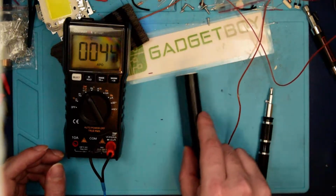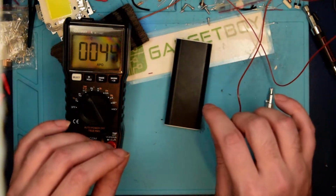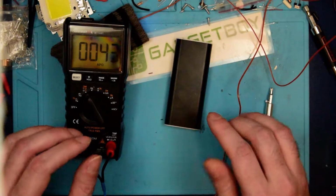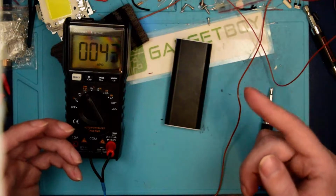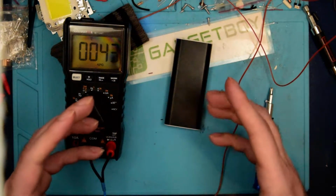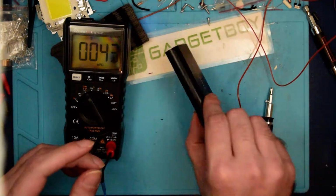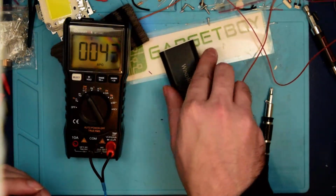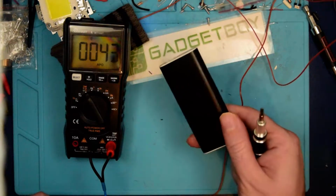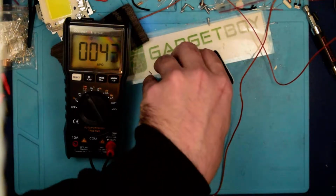I think we're going to have one and maybe two of those graphite-infused fiber panel things that are used for heating. Probably not going to have any sort of thermocouple or anything for regulation. I'm assuming it's pulse width modulation or even maybe just resistor controlled with a transistor that's going to regulate the current going to the panels, and then we'll just have your standard lithium-ion charge circuitry. The batteries are probably connected directly to the heating panels via a transistor, I'm thinking. Anyway, let's see if my predictions are correct and open this thing up.